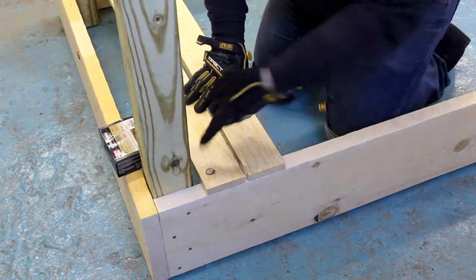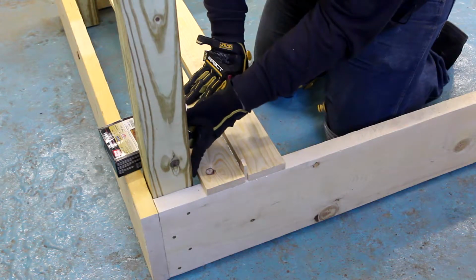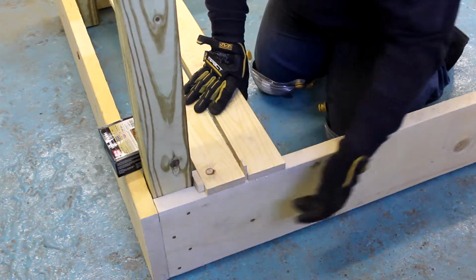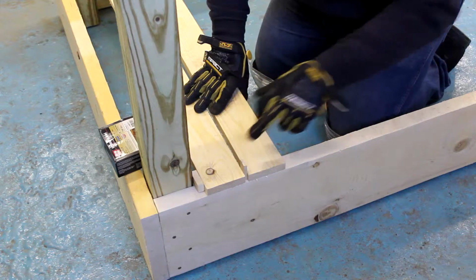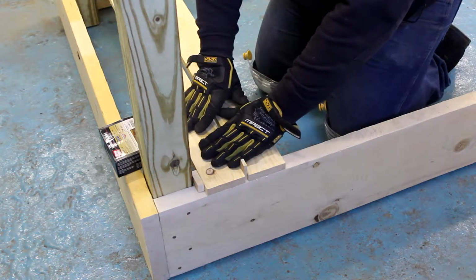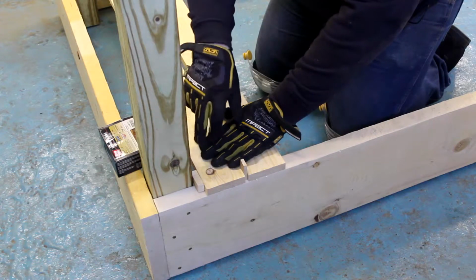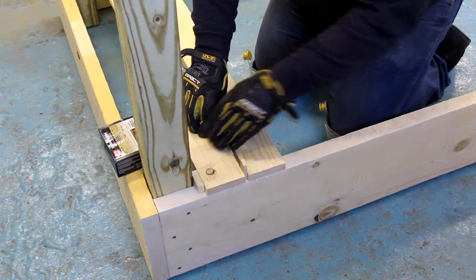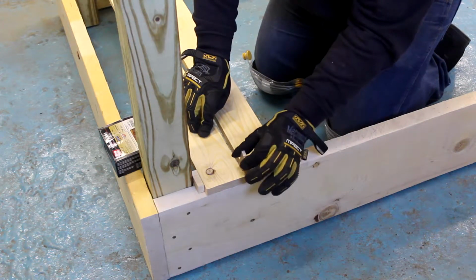And 1/2 inch is just for the very first one on the inside. So you're going to use the 1/2 inch on the inside here, 1/4 inch the rest of the way. And then start on the opposite end of your 8-foot section and do the same thing. Use your 1/2 inch first, put your 1x4s in, use 1/4 inch space in between.